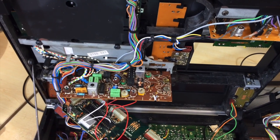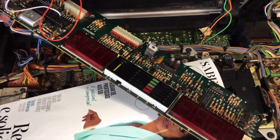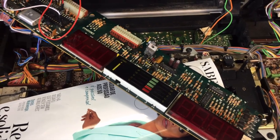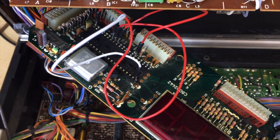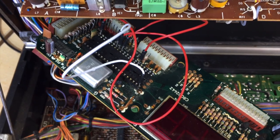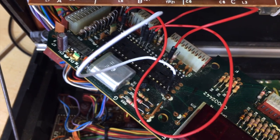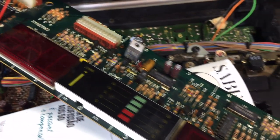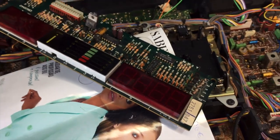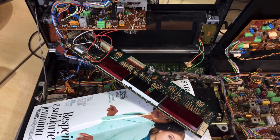And that's what's happened here. I had the processor board not responding at all. The voltages were there - I checked them. I actually got to the point of replacing the electrolytics because somebody said that could be the problem. Apparently these things do develop a reset fault, but the reset circuit is working on here. I have the full schematic - it's bloody huge, but you can follow it. So I decided to go ahead and see what I could do, and it's got to the point now where I'm doing things stage by stage, which is the only way to get this thing resolved.